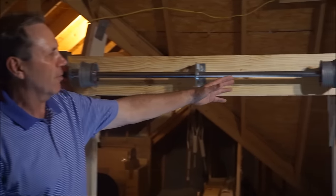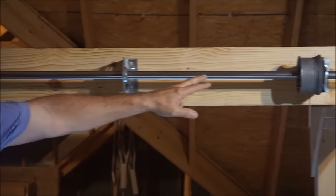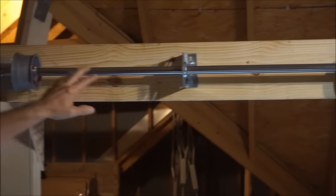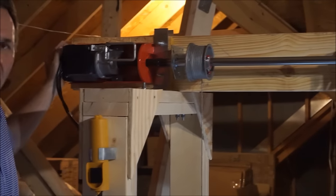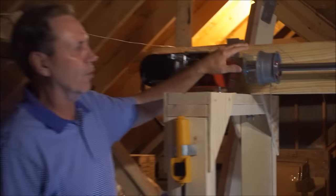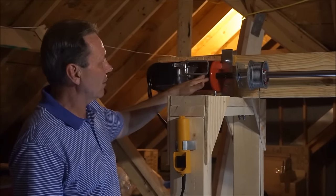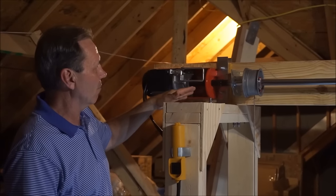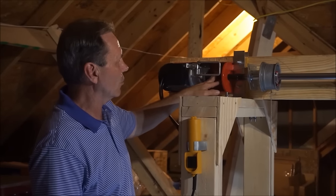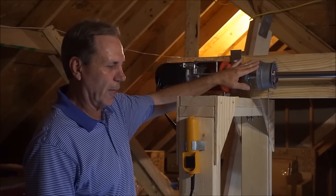First of all, we have standard garage door parts that we got from a company that services garage doors — the drums where the cable is controlled, and end plates that stabilize the steel rod. That's all attached to a hoist motor we bought at Harbor Freight. This hoist motor operates on 3.9 amps and has 400 pounds of capacity using two cables. We had to take the existing cable out of the frame of the motor and then weld a deep socket onto the tube and slide it over the shaft in order to connect the motor to the shaft and the hardware that pulls the cable up and down.